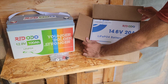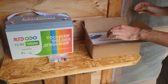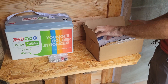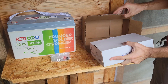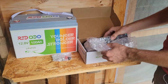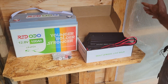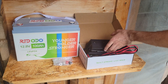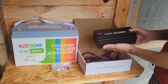They sent me a 300-watt charger, which is like a fast charger — it charges much quicker but uses more power. In the long run it's probably better to have the fast charger since it can charge the battery in about five hours. But if you're using it with a solar generator, definitely go with the smaller one. You can choose the 14.6-volt 20-amp 300-watt charger, or the 10-amp which charges at 150 watts and takes about 10 hours to charge a 100 amp hour battery.